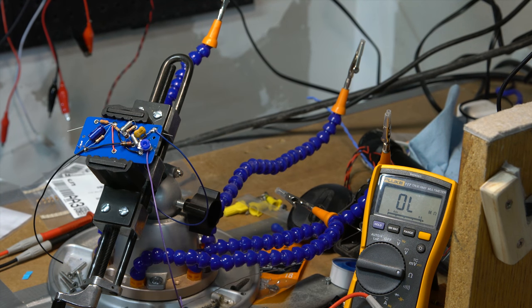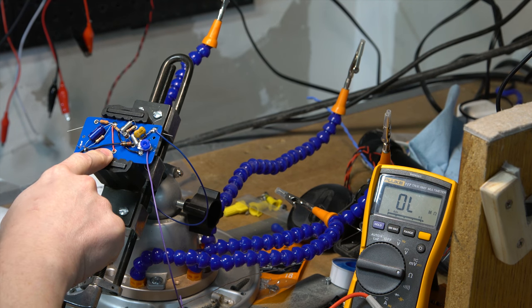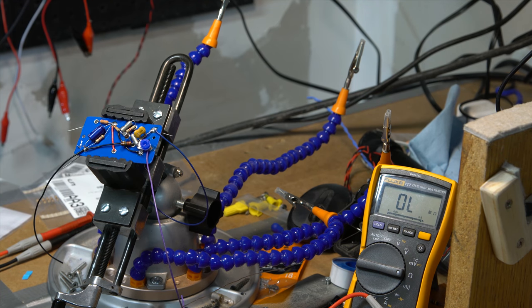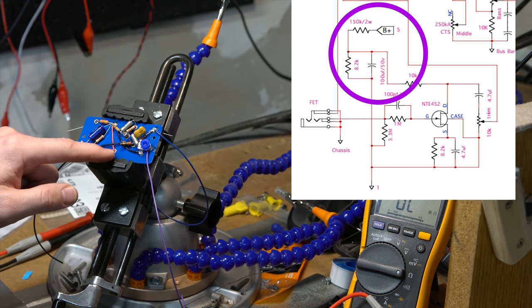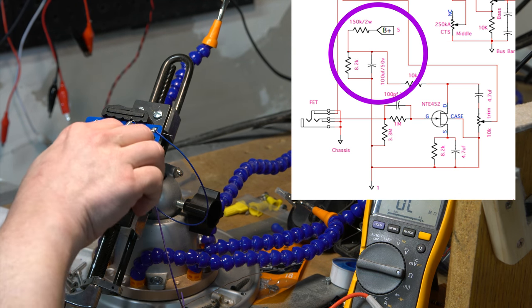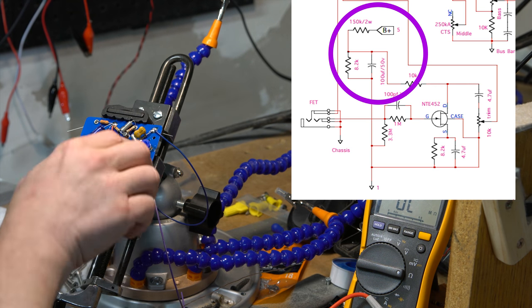I'm now looking at something that's confusing me, because of the high voltage that I jumpered over here. I don't even know that I need this now. I'm trying to figure out what I had done that for, because it seemed like I needed to have the B+ coming into that point, but it only connects to the 10K, so that's not needed. I'll just snip it here so it's easy to get it out of the way. It's just an extra connection I don't need.